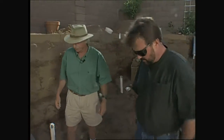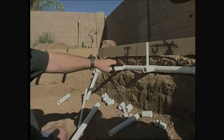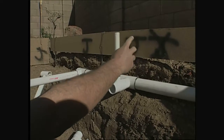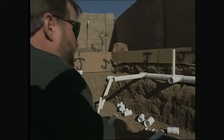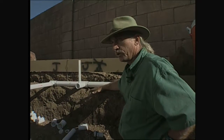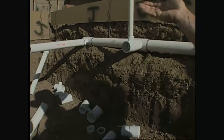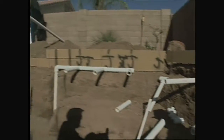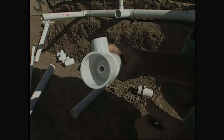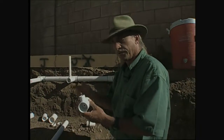Let's go take a look at the spa. This is the start of the therapy plumbing right now — this is the water line for the therapy jet, and here's the actual therapy jet itself. This is the airline coming down that will be attached to another two-inch pipe with a blower, where you'll get the air and water mixture and get that therapy effect. All of these pipes stubbed out here are the jet locations, and you've measured down from the top of the form board about 12 inches, so they'll end up being nine inches below water level. They can be adjusted to any depth or height you want. This little gizmo is the actual therapy jet — it's got a removable orifice in case debris gets caught. The water gets shot through this smaller orifice and draws air through the top — that's called a venturi action.